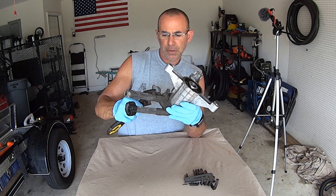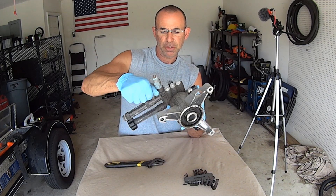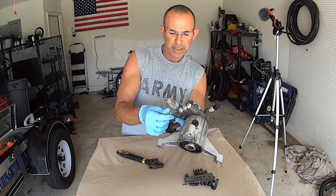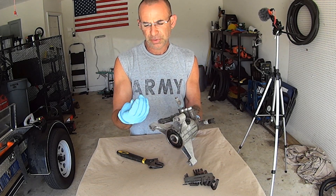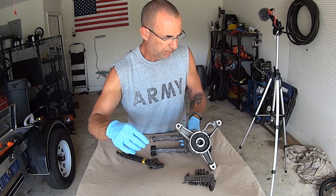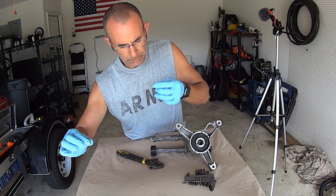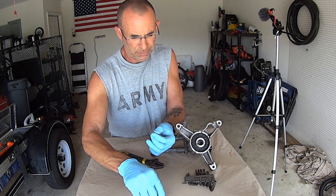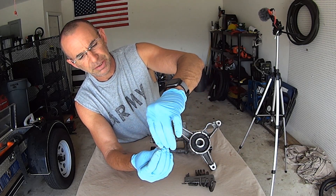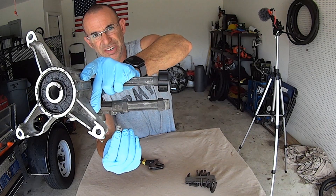What we're going to do is take this apart, because sometimes your check valve or downstream chemical injector siphon will get stuck. This is your downstream chemical injector — the ball just fell out. Here's the spring, here's the little ball, and the actual nipple itself. The ball is going to go right here, the spring goes on top, and then this mounts into here.